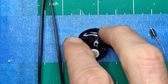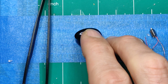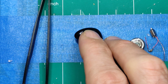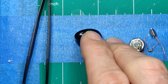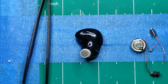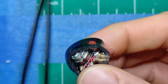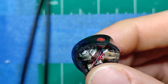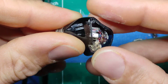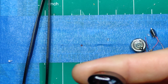On the 33518, there's a 10 ohm resistor, a 0.033 microfarad capacitor. On the Sonion BA, there's a 10 ohm resistor with a 6.8 microfarad capacitor, and then on the DD, it's just a 10 ohm resistor. So 10 ohm resistor on all of them, right? On the 33518, yeah. So 10 ohm on every single one of them, and then the capacitors. I should have written down the actual values, but this is before I did that.